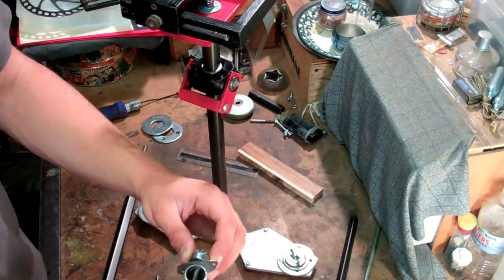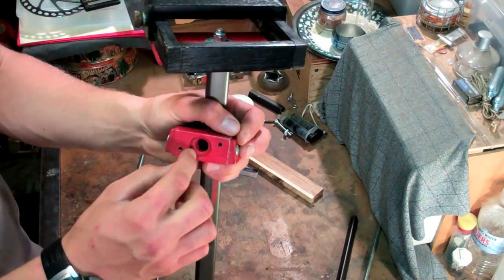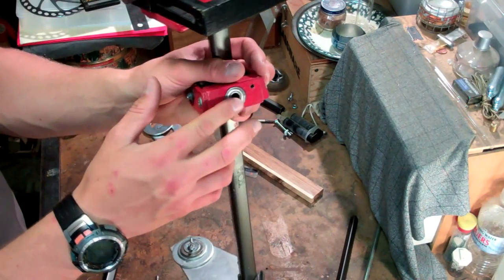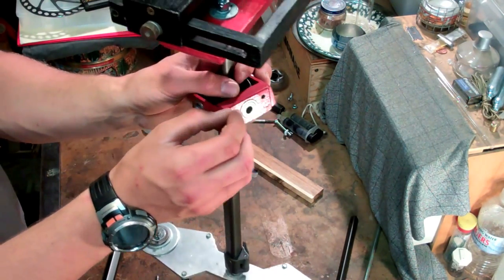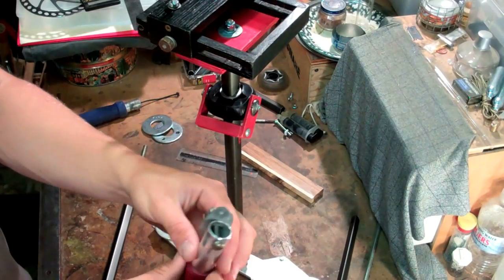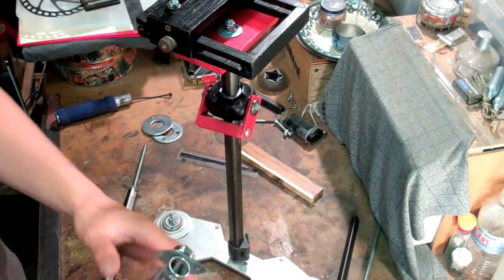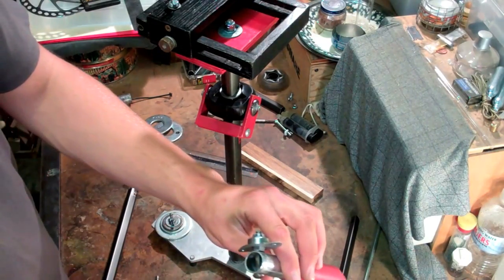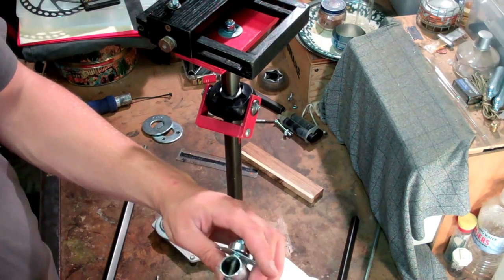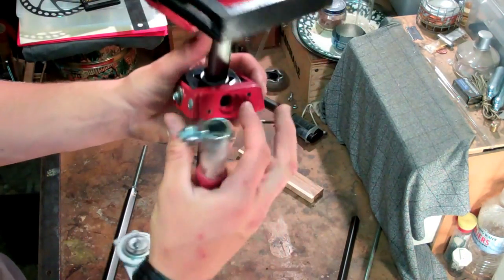The handle part is probably the harder part of the gimbal to make. In the back of the wood piece, you'll need to drill a 7/8-inch-wide hole exactly deep enough to fit one of the bearings, sitting almost flush with the top — just a tiny bit proud. Then drill a hole all the way through for the actual handle. For the handle itself, I used an old Razor scooter handlebar, but you could use a wooden dowel or anything you like. Drill a hole in the top all the way through and fit either a quarter-inch or 3/8-inch bolt to the top — make sure it doesn't actually touch the wheel and isn't too long so it doesn't rub.